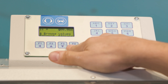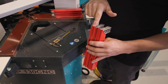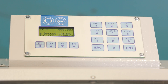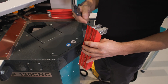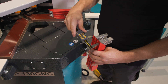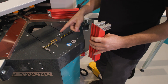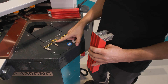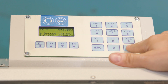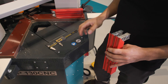The Z2 value is where the second blade will be placed. We measure the center from the bottom of the profile and get 44mm. Our upper blade is 4mm thick, so we move out 2mm from there, giving us 42mm. We enter 42, press Enter, move to the side, and confirm the value 42.